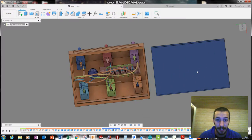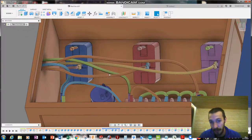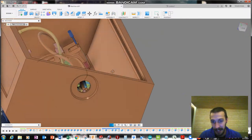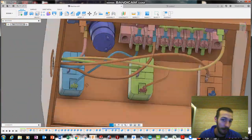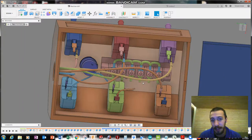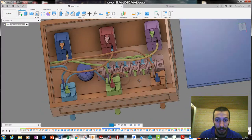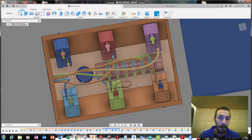What you can do is, if you know what switches and what you're going to add in there, you can really get a feel of: okay, I'm using this gauge wire — here's the thickness — and how big does this hole really need to be with all those wires sticking out? Is it going to be too tight in the box with too many wires, or do I need to adjust my gauge size? Sometimes when you're designing it's kind of hard to tell in real life where things are going to be or how they're going to fit, so you try the best you can in CAD.